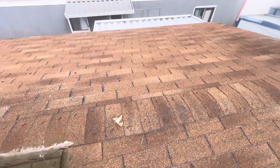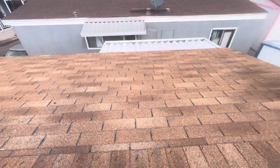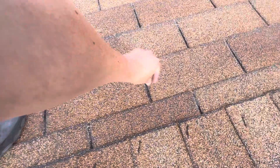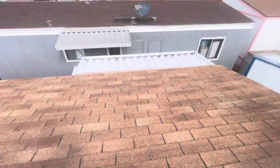Also, when they did this install they put nails in the ridge caps, which is a no bueno. We like to overlap these ridge caps right here on top. Another issue is the spacing on the shingles — they're too far apart. They're supposed to be more tight and staggered to help the water flow down.